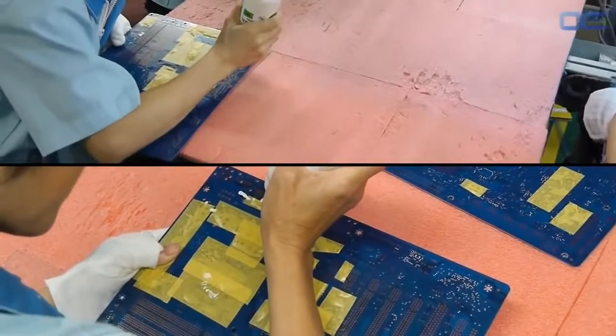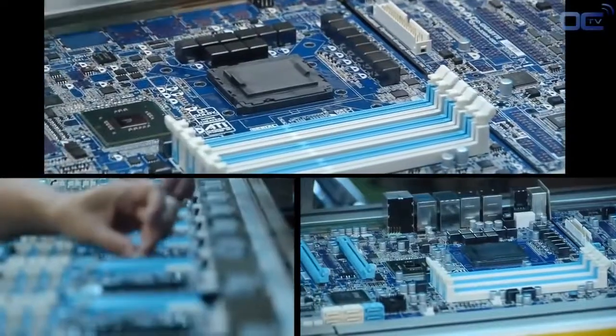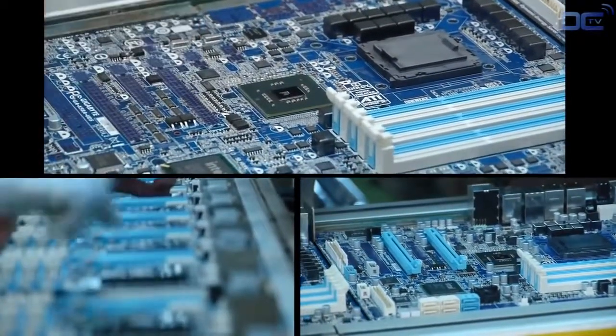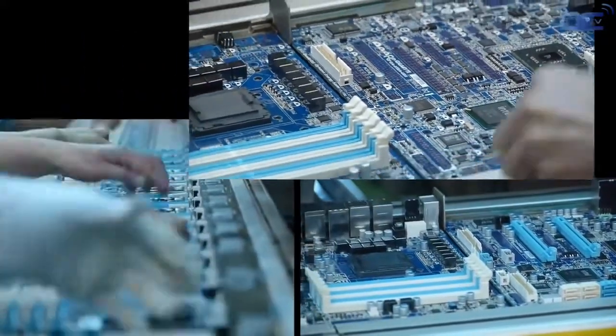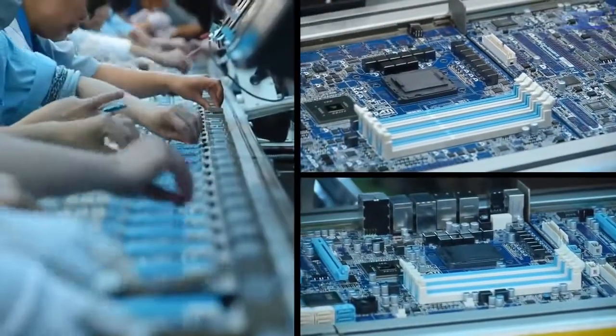The DIP stage is the second big important process when making a motherboard. First, you have a manual insertion. All the small components and the chipset have been added already. It's time to plug all the other components that go through the PCB. During this stage, all the components are manually inserted.